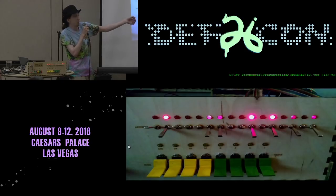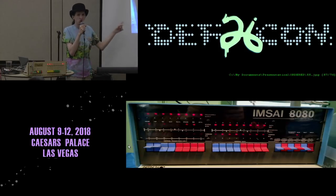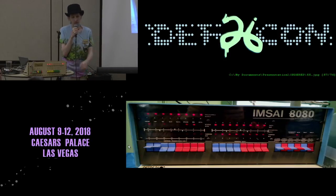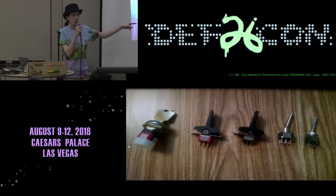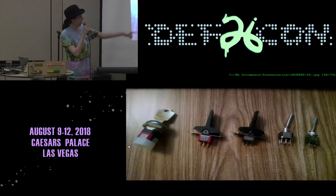This is what it looks like when it's running. You have a top row of locking switches to set your address, you can see what address you're actually at, and you've got flip switches for your data bus. The switches I really like are inspired by the IMSAI 8080's design — those paddle switches are so nice. The problem is they're a pain to get. C&K switches — these momentaries — are really expensive. They discontinued the J4 and J5 paddle years ago. I found mine at Electronic Goldmine and bought out their entire stockpile — all 19 switches. Turns out NKK makes a new version; it's a little crunchier but gets the job done.